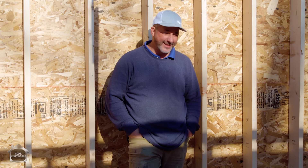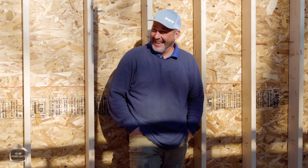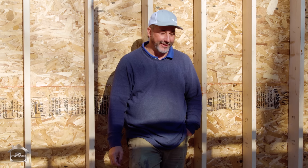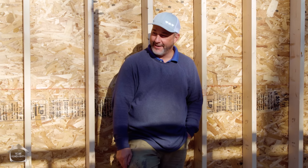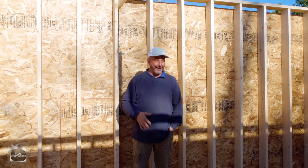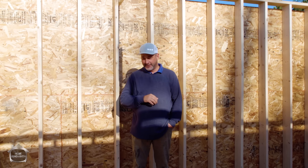All right, it's day two. I said at the beginning I was going to do it in two days — that's ambitious. I'm getting old. I finished at three yesterday and didn't get started until after 10, so it was only a five-hour workday. I keep calculating things with the younger Jeff who would work 10 hours straight. Today we're going to get the rest of the sheathing finished, frame the two doors, build a ladder above the front wall for horizontal windows. I think it'll be a really cool feature — get a lot of daylight in here. And then we've got to get the roof on. If we can get the roof on today that'll be great, and then we can put house wrap on.